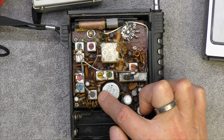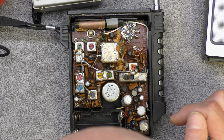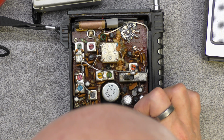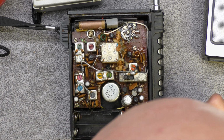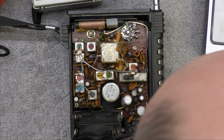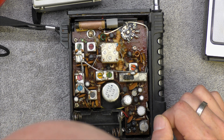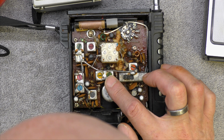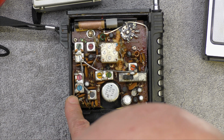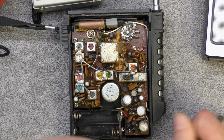Oh, there's a detector diode there. Should be a pair somewhere on the FM side. Oh, there's another one there. Oh, I'll be looking for a pair, but I'll discriminate. But I can only see 2 single ones. Oh well, I'm sure it's here somewhere. Another diode there. Always difficult for me to work out which is which. So many different colours. Oh yes, I see the second diode hiding under there, so that's probably the discriminator for FM then. Nice bit of shielding there.